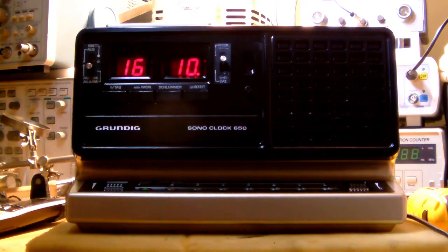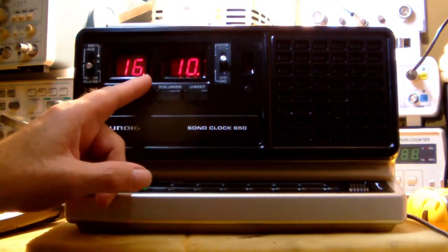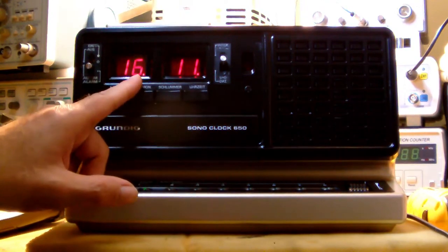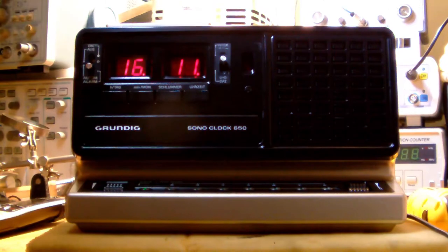The clock itself is built around a Fairchild FCM 7010 clock chip. And that chip is really special in the sense that it is a very large chip. It has 40 pins, in fact, so it's very wide. And it also allows for direct drive display, meaning that every single LED which forms the display is separately driven by the chip, which you could argue makes the chip overly large and probably makes it consume more power than technically needed, but it also makes for